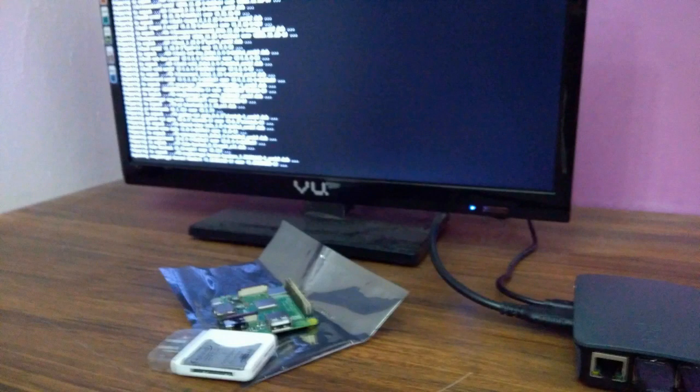We need either Raspberry Pi 3 B+ or B to run the instruction from the terminal to make the SD card ready for Raspberry Pi 3 A+. RetroPie will not run straight out of the box for 3 A+ right now. I'm sure RetroPie and others like Recallbox, Batocera, and Lakka will definitely come up with a newer version for Raspberry Pi 3 A+ shortly. So at that time we may not need to follow all these instructions. But if you want to start using Raspberry Pi 3 A+ from now, you can follow this instruction like what I am doing right now, and you can start playing the game from now.